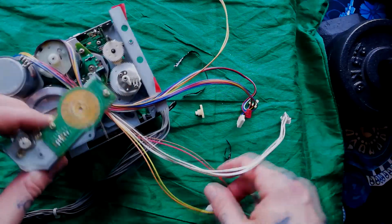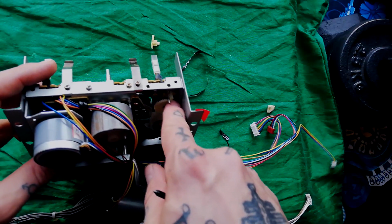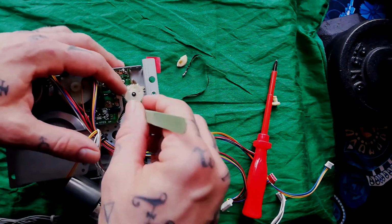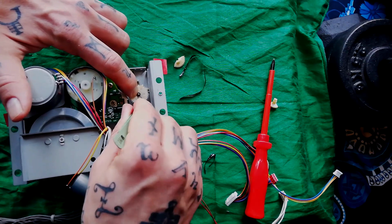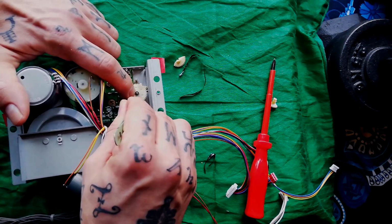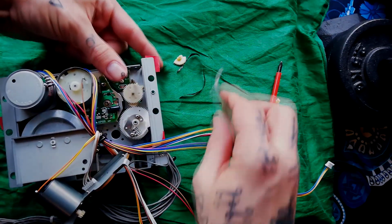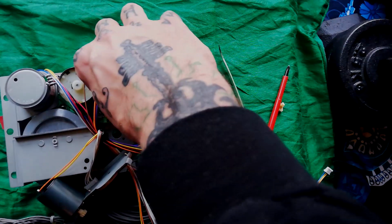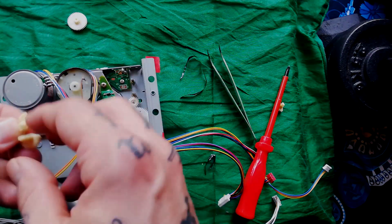Okay. And that's come off, and yeah, there's part of gear C, it's snapped. It would be sitting here. You can see there's the other bit. Need to get this little plastic clip off here in order to put a new gear C on there. You've seen me dealing with little plastic clips like this before, changing the idler tyres on a 244 transport. I find that you just need to find a split in it and then get under it with tweezers, holding it still with a fingernail. Quite often you'll make half a dozen attempts before getting it. Yeah, so there's a risk of that flicking away. I was fortunately not stuck to my thumbnail, so that'll lift off, and you can put your replacement gear C in there.